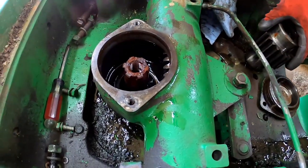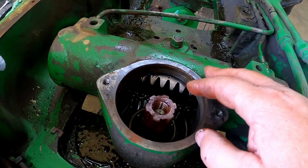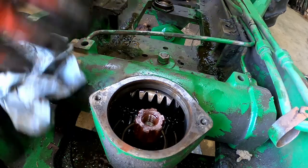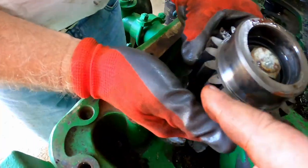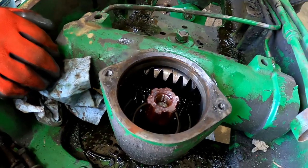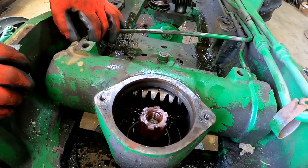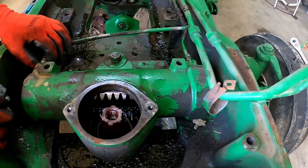The quad ring turns against this gear and over the years dirt gets in, the rubber gets hard, gets ground down, and it stops sealing. I turned the piston just a little bit so we can see the dot better — there's the dot you need to line up with the dot on the gear. There's one on each side because they're 180 degrees off, so either one works. But if you get off by one tooth you'll steer farther one direction than the other. I've had to take one or two apart over the years because someone didn't line up the dots.